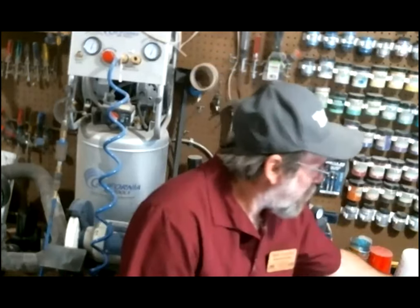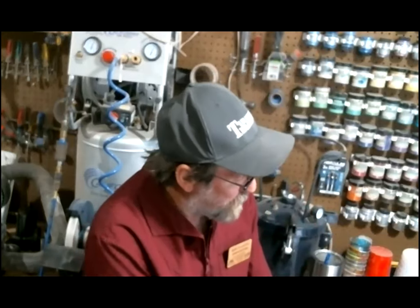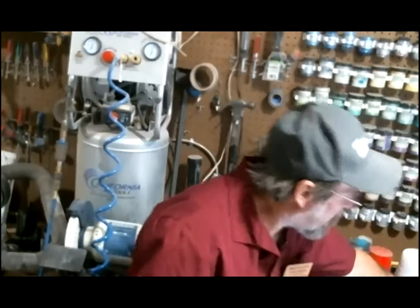Yeah, I mean, it just is. Also, if you're running pressure pots, keep your lids lubed up. This one hasn't been cleaned in a while. Keep them lubed up, though. I use Vaseline on the seals. I'll blow it off real good, take the seal out once a month or so. But I cast every day with these two, so, and then I'll re-Vaseline.